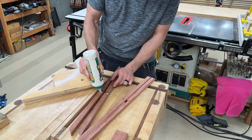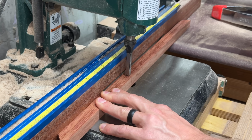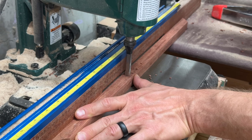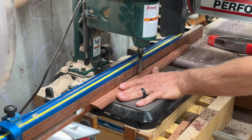Oh, hang on though. Got all excited about selling stuff and I didn't finish the build. I've got to glue up the cross pieces and then cut a mortise and tenon that slips together at the base for one of the assembled connections that doesn't have a pica screw. The only one, actually. All the other ones are pica screws into threaded inserts.